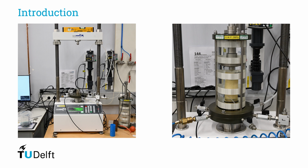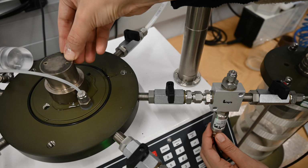Let us start off by giving a short description of this test. In the Triaxial test, a cylindrical specimen of soil is covered in a rubber membrane and placed in a cell filled with a pressurized fluid. The rubber membrane ensures that the fluid does not interact with the sample, and only pressure is applied. Drainage is provided at the top and bottom plates, allowing water to exit the soil sample if required by the test. Through this duct, pore pressure can be measured and, if allowed, pore water can flow during consolidation and shear.